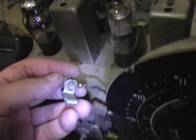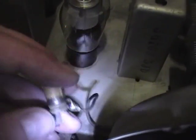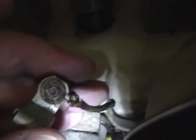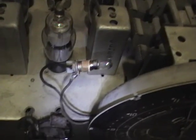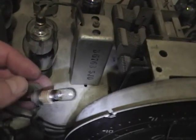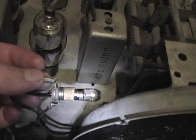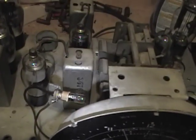After a lot of cursing, I finally found where the fault lies. There is no electrical connection between the mounting bracket and the center contact pin down there — it seems like this bracket has broken loose from the solder pad. I made a bad assumption that one lamp terminal was going to the mounting bracket, which in most radios goes to the chassis ground. In this case, this clamp is actually not connected to either terminal. So I had to connect the ground lead to the center pin and the hot lead to the side pin. Now the lamp comes on.